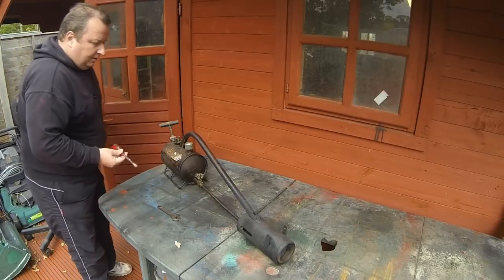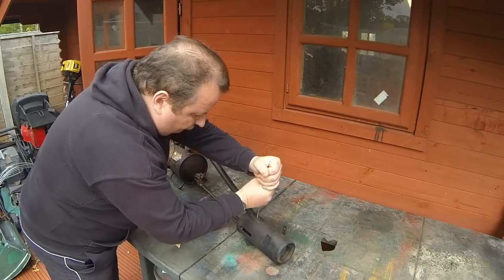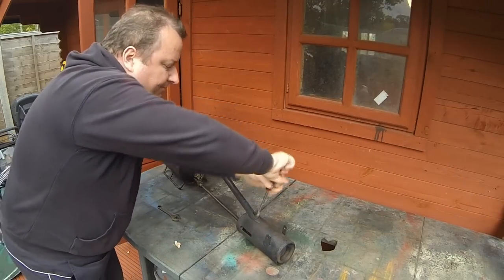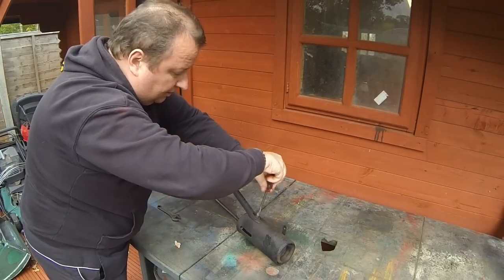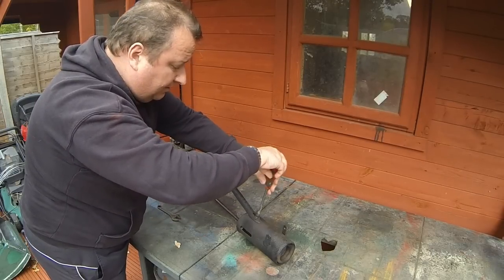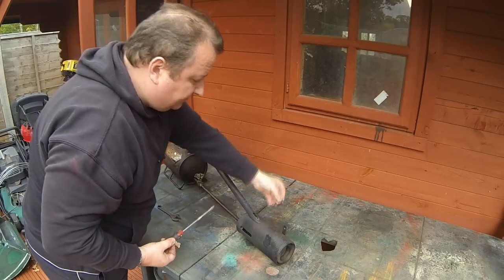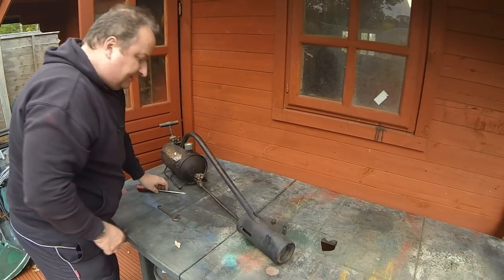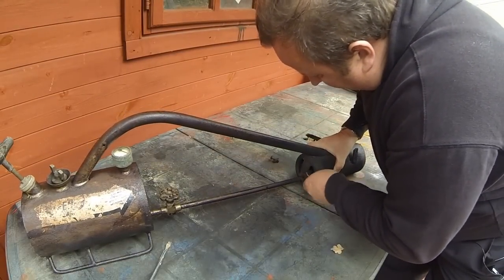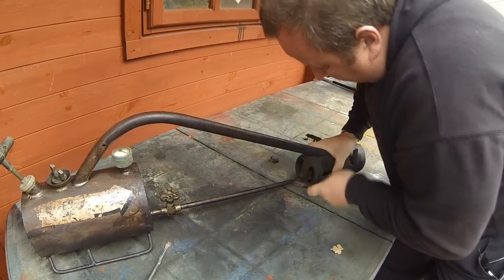Right, okay. Now the valve's off, clockwise position. I've just got to undo this big screw here. Now, as I say, I did this up yesterday, but this obviously gets very hot and the threads are very dry, although I did lubricate these with some copper slip grease yesterday, but obviously that's all burnt off. So that's that out of there, and I just need to undo this nut here on the back of the actual burning unit. There we go.